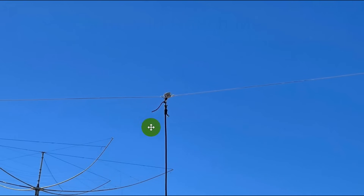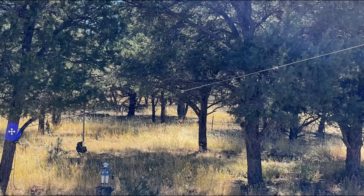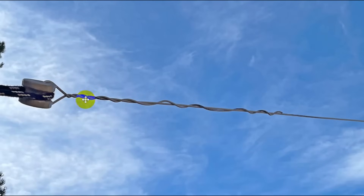Taking a look at the center of the dipole — right here we have the wire going out each side. This is up by the top of the 30-foot mast, with a few feet of rope to insulate the dipole from the metal mast. You can see where the wire is wrapped around right here. This is the ground end where we've got a piece of rope to a tree, and you can see the insulated wire has a fair amount wrapped back on itself.